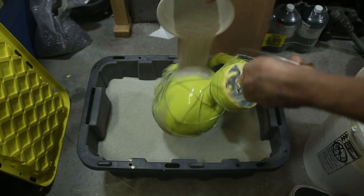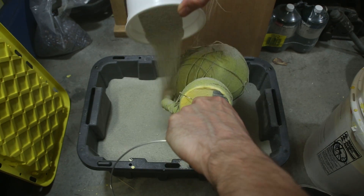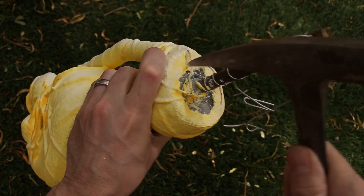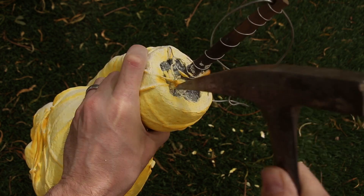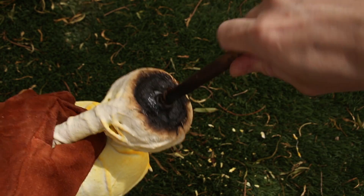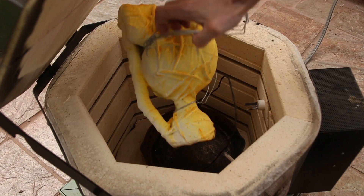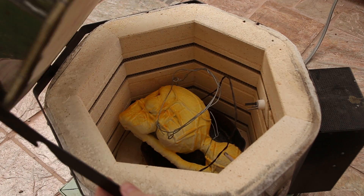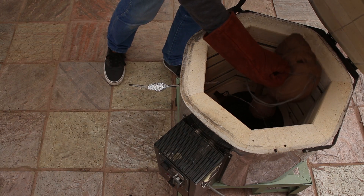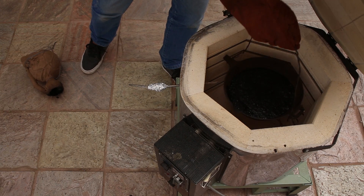I coated the skull with another five coats of slurry and then allowed it to dry in the sun for a few days. Once the shell was completely dry, I placed it into my kiln and brought the temperature up to about 500 degrees Fahrenheit or 260 degrees Celsius. At this temperature, the wax and PLA melt out of the shell without catching fire and can be removed from the kiln. I've found that Overture Black PLA burns out without leaving any ash behind.